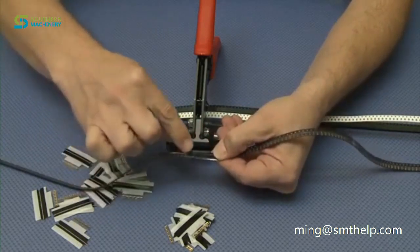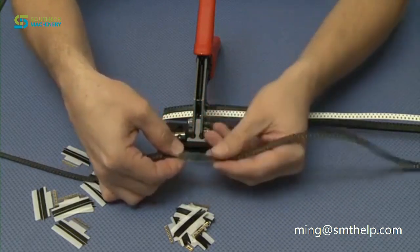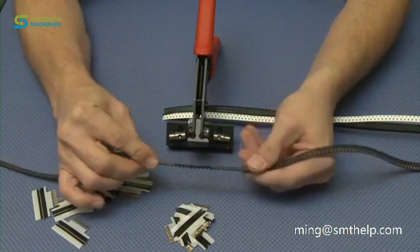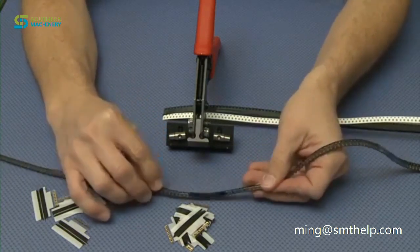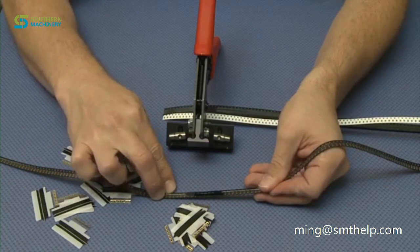You will see that there are two rails of tape — one on the sprocket drive holes and one on the component holes. We then will peel the clear plastic piece off, which will leave you a splice both on the top and on the bottom. This will make it easier for your machine to run, and you will have the alignment pins covered to be able to detect a splice on a Panasonic pick and place machine.